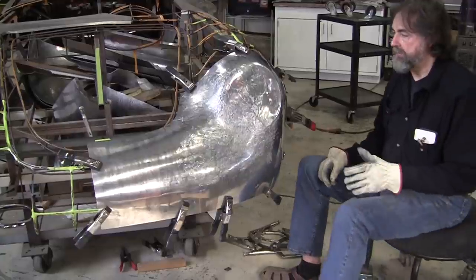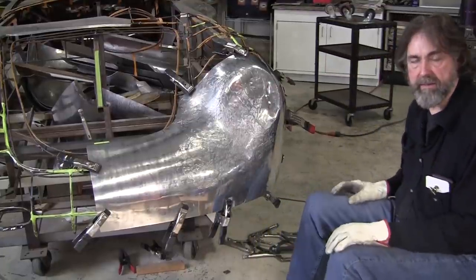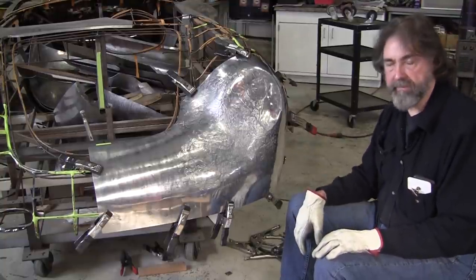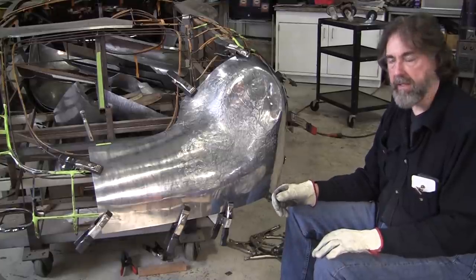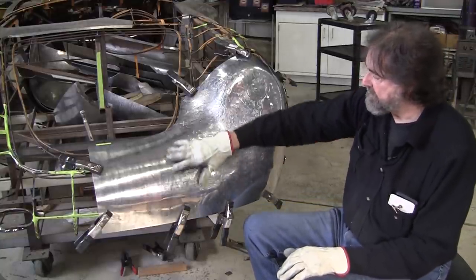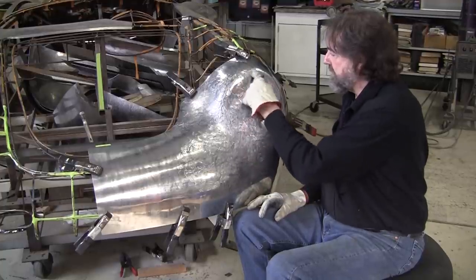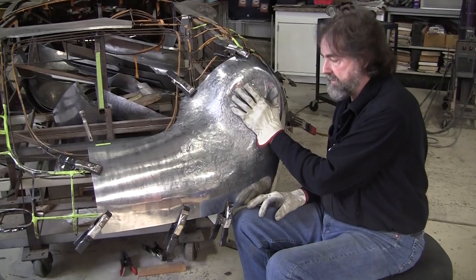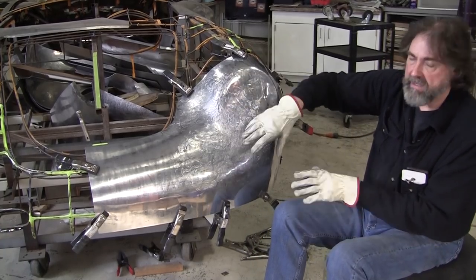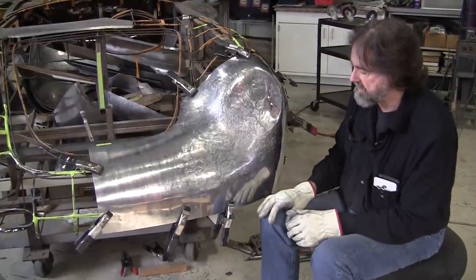So where we are now is we got a few more spots that we got to do in this video. I don't want it to be too long. Mark's going to speed up a lot of the stuff, but I think you got a really good idea of what that potential is of the wireform buck. And the next time we'll refine this a little bit more so that it flows really nice. It's flowing pretty nice now, it fits nice, but we got to get it perfect, and we got to seat this headlight seat right on the wires, and then we'll do a trim on it, because there's a lot of extra metal. And after we do the trim, it'll be easier to fine fit it, and then that'll be the perfection of the panel, the last stage.